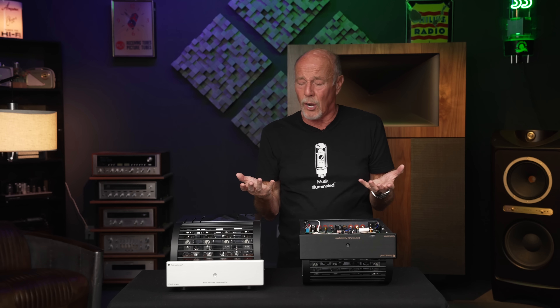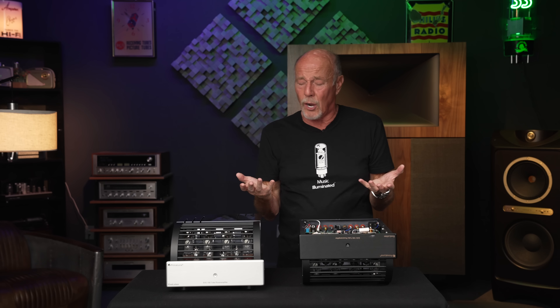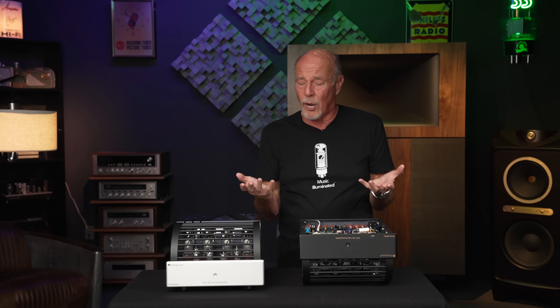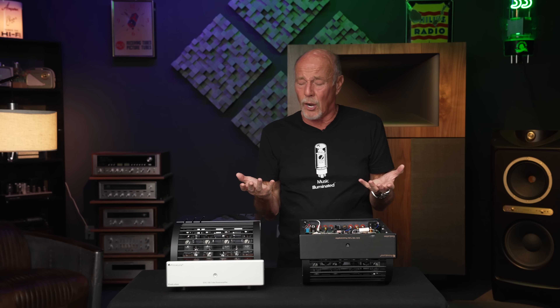Up front you've got a pair of 12AX7s — those are the most important tube. On the PrimaLuna website we have a whole series about tube rolling and all the fun you can have with it. There's a switch on the side for fine-tuning the bias between smaller dissipation tubes and the big tubes, because you can run EL34, 6L6, KT88, KT120, 6550 — a slew of tubes. There's also what's called a doomsday tube fuse on the side that you'll probably never have to access, but if something really weird happens — like one reviewer who tripped over his power tubes — it can save the day.